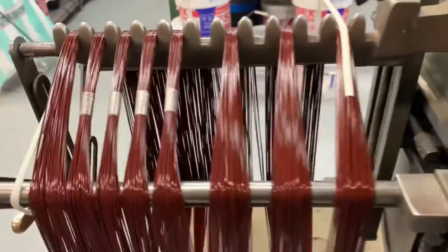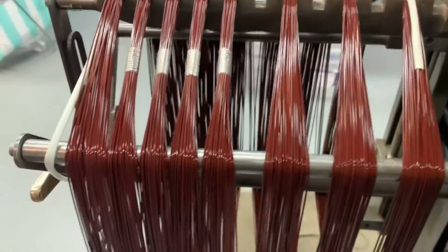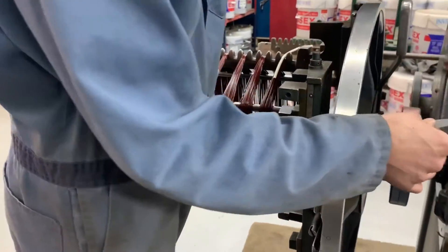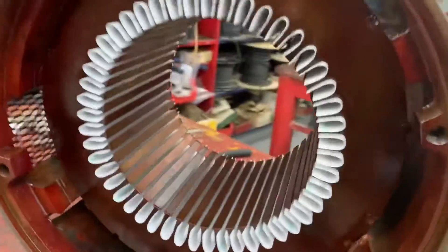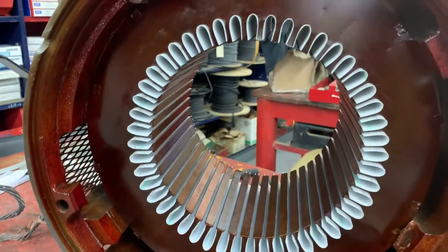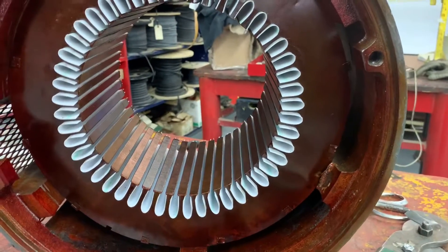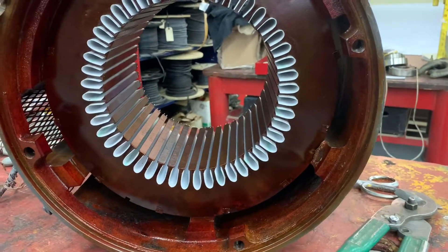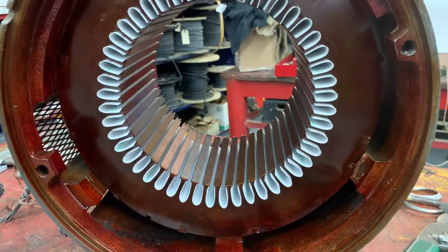So eight — yeah, eight groups of coil, six groups. There you go. Done? He made already two coils here and this is his motor for rewind. It is a high speed six group — or eight groups of six, two poles. Six groups of eight, sorry — six groups of eight, two poles. This motor is from the sawmill, it's a planer stator.